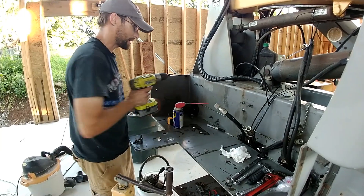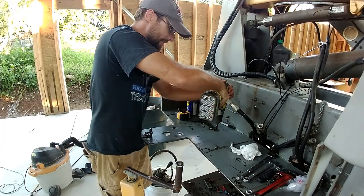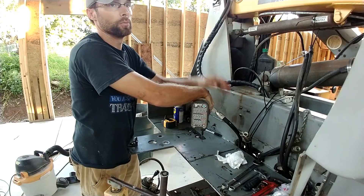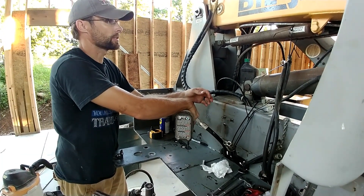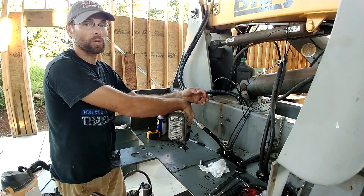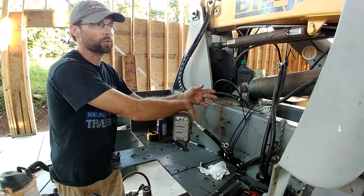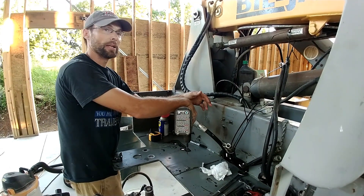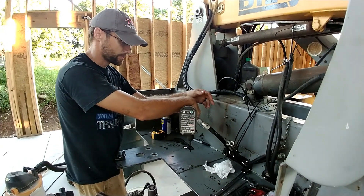This is the lift — it's a hydraulic lift. All the hoses for the boom were changed when we bought it, because they were really bad, all crested and cracked, and I was afraid one was going to break. Typically on hydraulic lines, once one breaks they all start breaking. So I replaced all the main hoses up to the boom. Of course, what I'm doing now is completely eliminating all those hoses I put in, so it was a complete waste — but that's okay.